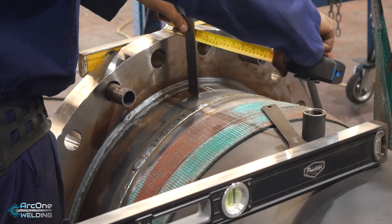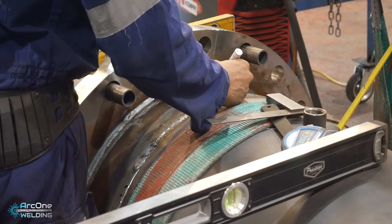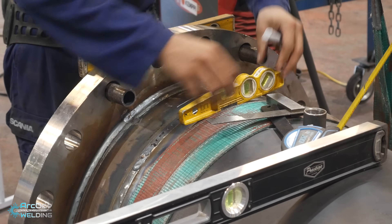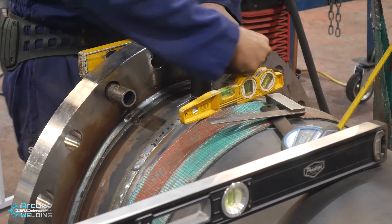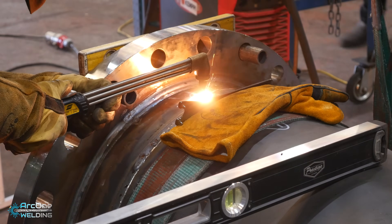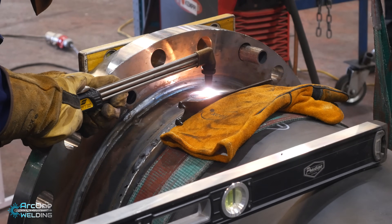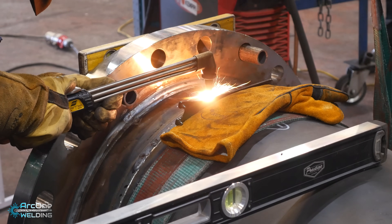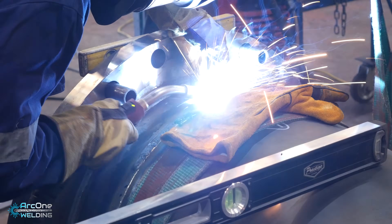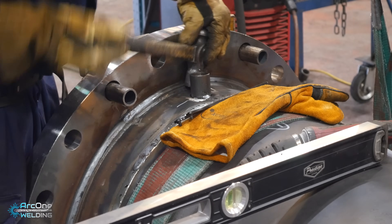Finally, the last part is the socket. This is a one inch socket, and guys please - this is not a thread protector, it's not scrap, it is actually a weld-on socket that can hold I believe around 40 bar. The pipes I'm doing are only operating at around six bar and it's only chilled water going through it. So before you start commenting saying 'in the oil field you couldn't do that' - just bear in mind you don't know the specifications I'm working to, you don't know the industry or the client this is going to. Better yet, you are not smarter than the people who actually commissioned this job.